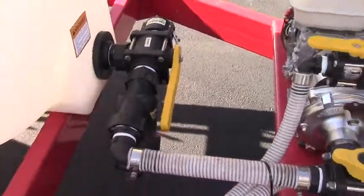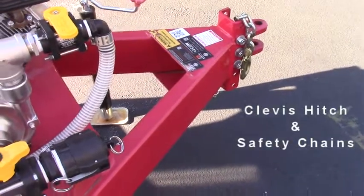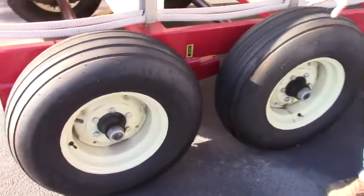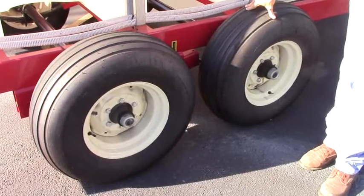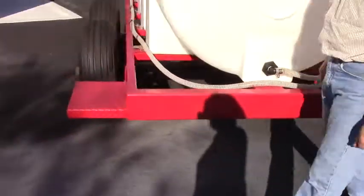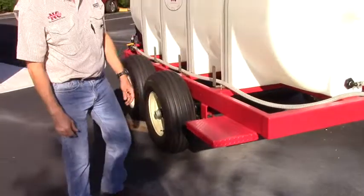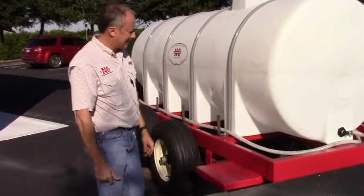The trailer has an adjustable Clevis-style hitch, standard in all our units, with safety tow chains. It's 2x6 construction rectangular tubing. The trailer comes powder coated. Our standard tires are the 11L15 implement tires with 7,000 pound Dexter axles. We have stainless steel hose brackets that contain the hose while traveling up and down the road to keep them from falling in or getting in the way of the tire. We also have a step on the rear of the trailer that allows access to the tank lid if you want to pour chemicals or inspect the inside of the tank.